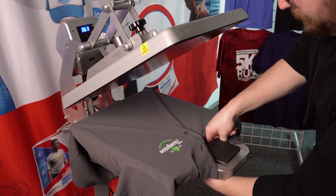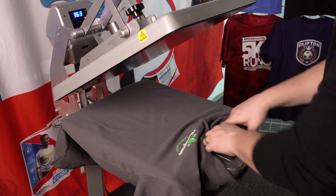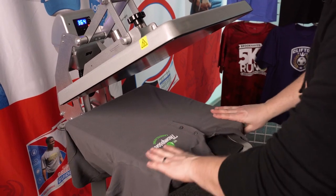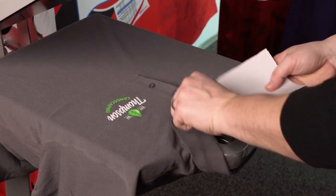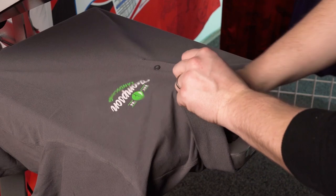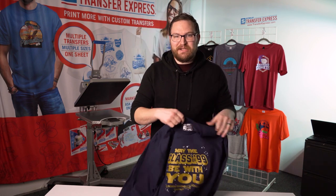This even makes printing polos a little bit easier. You won't be able to pull up the back inside — it's a little tight with the extra collar — but what you can do is get the polo on the platen. Where you'd traditionally have issues with a square platen, you now have room to fit one of our mouse pads, cut to print size for a left chest, fitting right under the print area. Press, then easily remove the print pad and the polo. Just like that — super easy to add the front print and inside tag print at the same exact time.